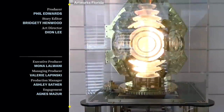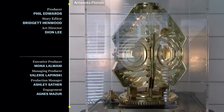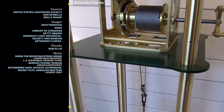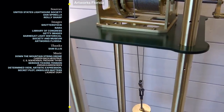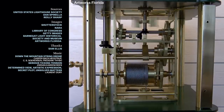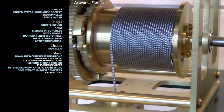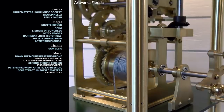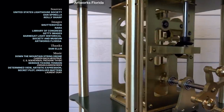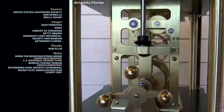What they did to rotate the lenses, they used a clockwork mechanism. They didn't have electricity, they didn't have electric motors — they used a clockwork mechanism very similar to a grandfather clock. There's a weight that would drop down the center of the lighthouse, attached to a cable which was wrapped around a drum. That drum had a gear on the end of it, and that gear drove a series of gears inside the clockwork mechanism. The ratio of the gears determined the speed at which the lens would rotate, engaging with a gear underneath the bottom of the lens. The lens was on either chariot wheels, ball bearings, or in some cases a mercury bath that allowed it to rotate. This was built as a demonstration for the Pensacola Lighthouse.